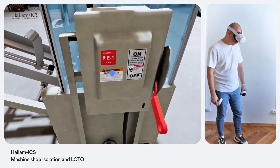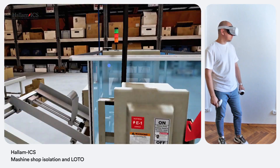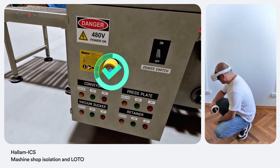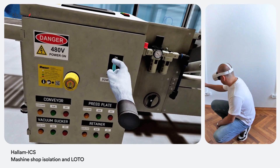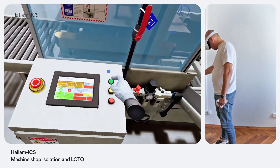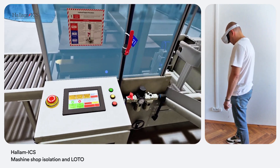LOTO devices removed from the main safety electrical switch. Perfect — now turn the switch back on. Safety electrical switch is now closed. Good. Now confirm the presence of voltage using the VerySafe unit at the control panel. The power is back. Turn on the main circuit breaker at the control panel. Done. Attempt to start the machine via the control panel — let's see if our repairs have done the trick. Machine started — everything seems to be running smoothly.